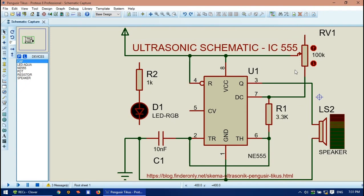In the real device, you might not hear the sound frequency produced by the piezoelectric, because humans cannot hear sound above 20 kilohertz — human hearing ranges from 20 Hz to 20 kilohertz. Technically this schematic is good enough to be made as an ultrasonic sound maker, but you have to make sure you are using a good quality piezoelectric.